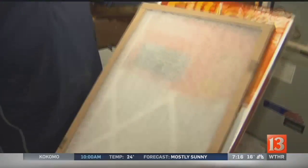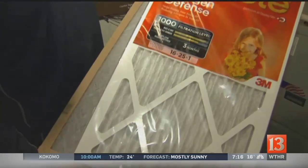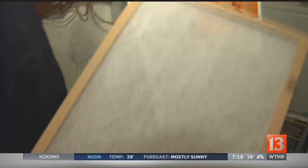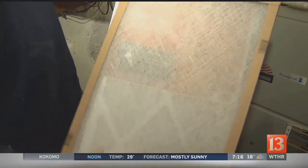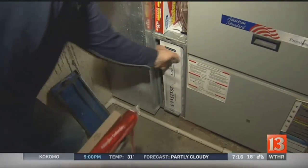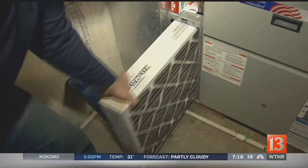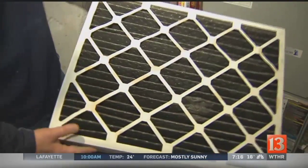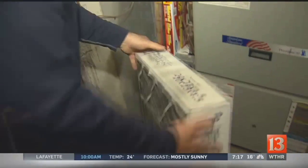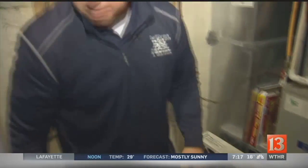Filters are so important this time of year. If you're using high-efficiency filters and the house is dirty, I would replace them every couple of months. The plain old fiberglass — same thing, although they're never going to clog. This particular furnace has one of the big ones on it, and you can see how dirty that is. This is my neighbor Ted's house — you can see how filthy that is because Ted never does anything. So we'll take care of that for him.